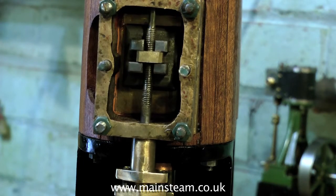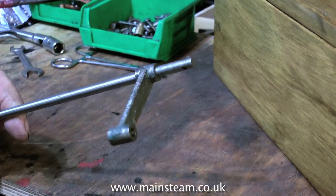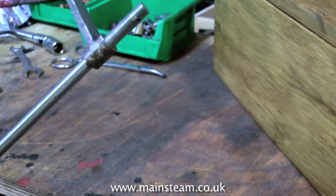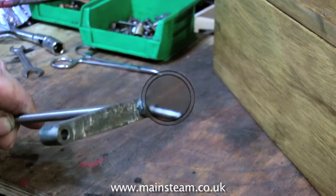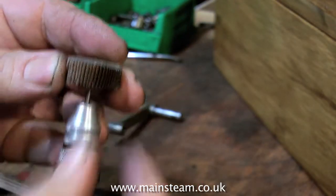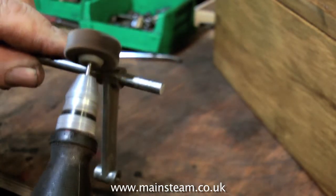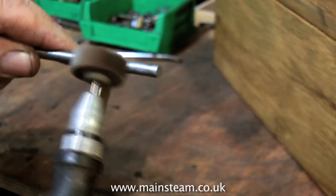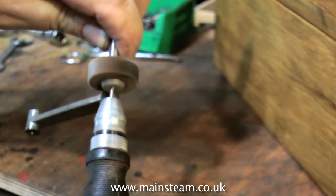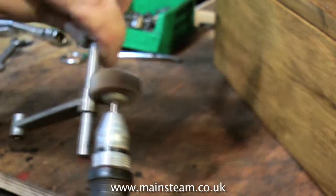Over now to the valve gear. The valve gear is not very well made, like most of the other parts of this engine, and it needs a good clean up — with a needle file, followed by sandpaper and a needle file again. But sometimes I use this to speed the process up. This is called a flapper wheel, and it consists of a load of pieces of sandpaper that spin round and clean up the part — you can get into the corners. The good thing about a flapper wheel is it doesn't remove too much material, but it does remove the surface rust.